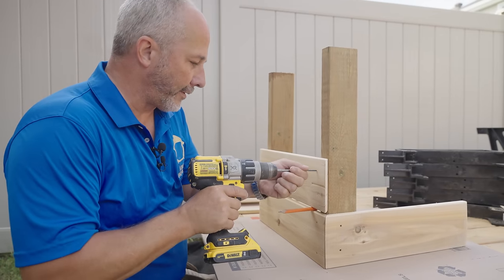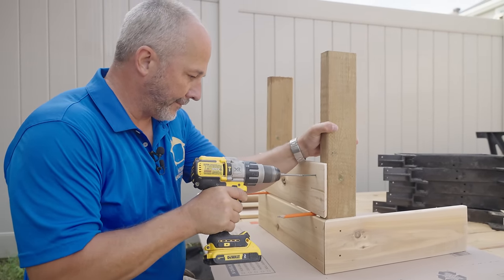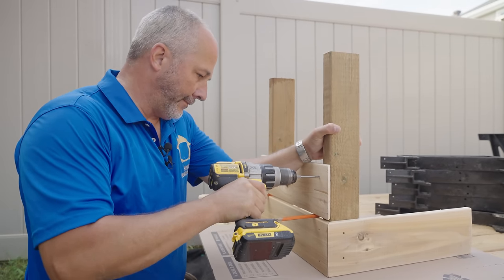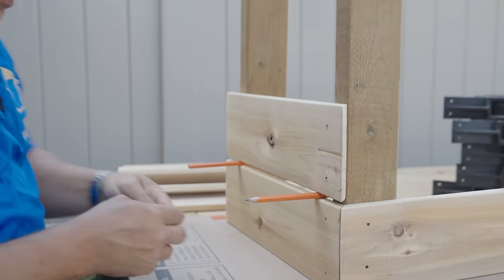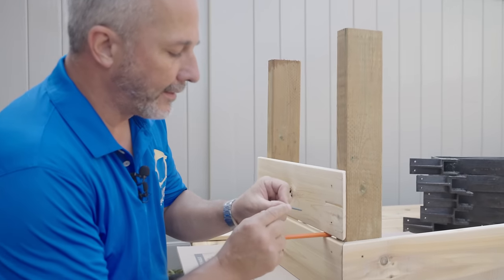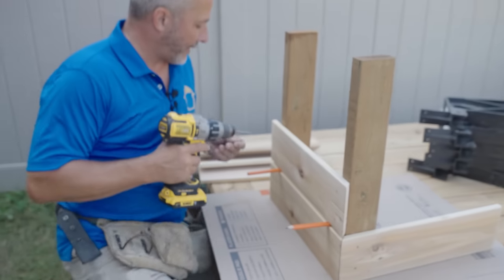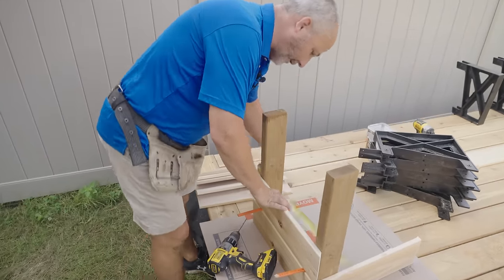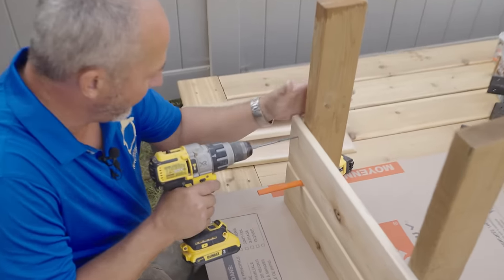You don't have to be a woodworker to make this furniture. The best thing about this screw is this side is designed to drive into the wood, and this is reverse threaded, and it pulls the surface tight. That's how you get this amazing result. We'll try to make this square if we can, 17 1/4, because that's going to make a difference when we go to cap it. Here we go.